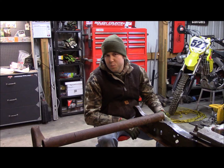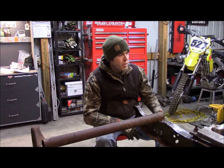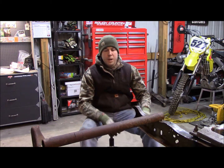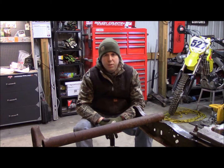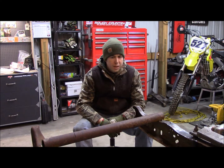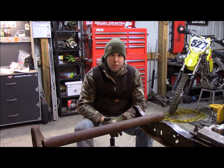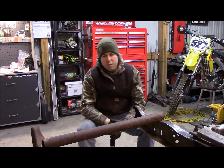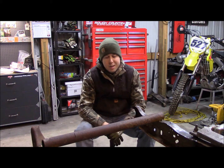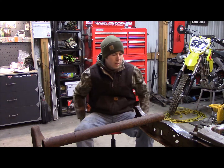Last night here in Catlettsburg, Kentucky, I got my steel order in, like I mentioned in the last video. So tonight I'm going to disassemble what I've got together here and take the crossmember back out. I've got some lines already marked on portions of the old frame that I'm going to have to cut out, where Ford had it rolled down back where the clutch assembly and the cab mounts are. So doing a little cutting here this evening.